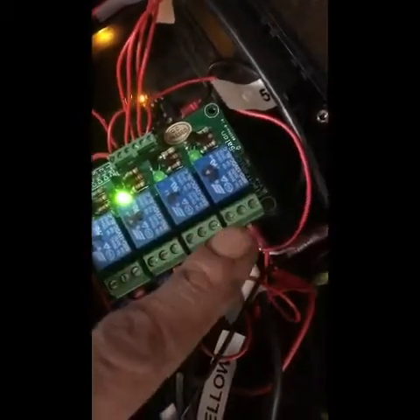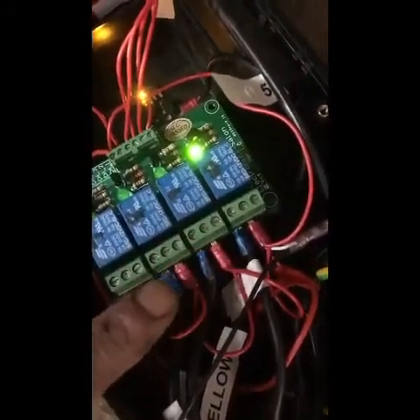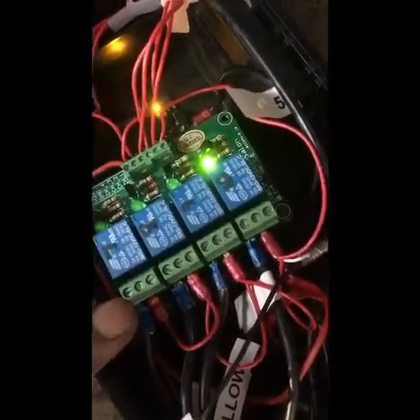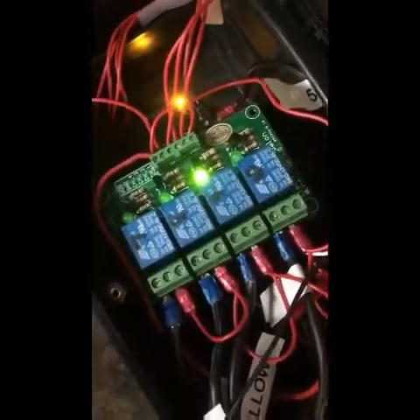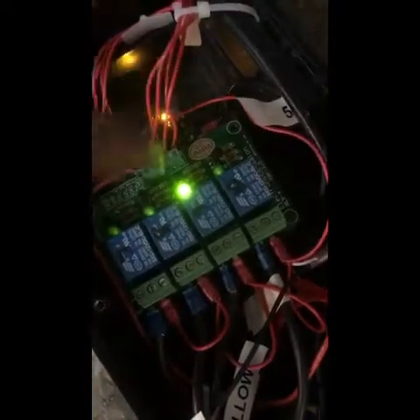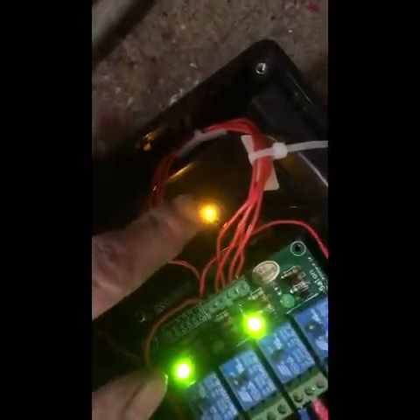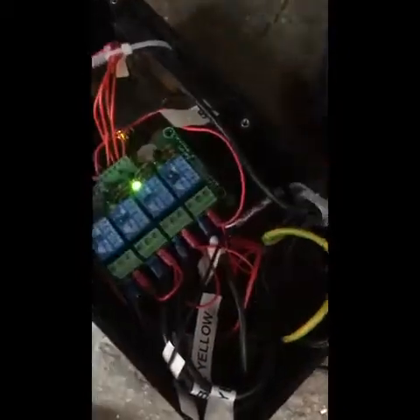I've commoned up all the negatives going to the lamp, and these are your main feeds to the lamps — red, yellow, green, and double yellow — and they go on to the common on the lamps, so you can still have the pole change on the lamps for auxiliary filament drop-in as well. Down here on your chip, there's a telltale light to tell you the power is on. You've got to keep the chip in a very dry environment; the slightest touch of your finger trips the chip off and it starts cycling through different sequences, so it's kept in its own little space. There's also a kill switch just to turn it off so you don't have to keep going in and out of the box.